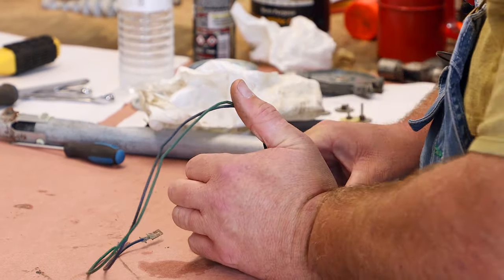Expect to have difficulty, guys. I've done hundreds of these. In fact, one of your cars may have one that I did. I like to let it run while I tighten these down to make sure nothing binds. Just keep the current in mind if your power supply has that, so you can monitor how hard the motor's working. Now we have our new mast.